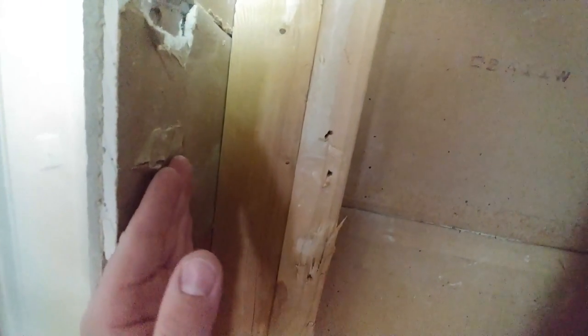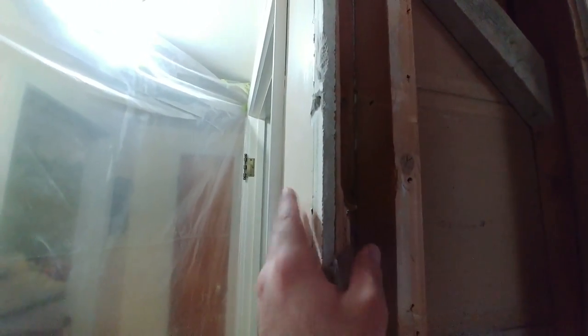That'll support coming around the corner with drywall to do a link-up here, or whatever board we end up using. Ultimately this will become a smooth face over to here, turn and go down this wall — simply a finished corner, without some sort of take-off abutment thing sticking out. We'll get this all packed out, the beam end will sit on that, and that'll create the pocket that supports the beam end.